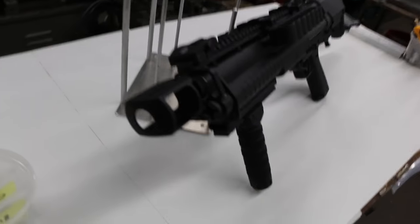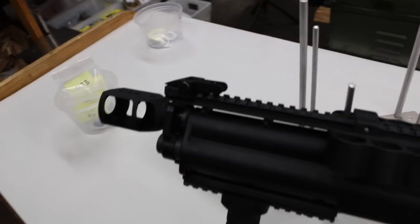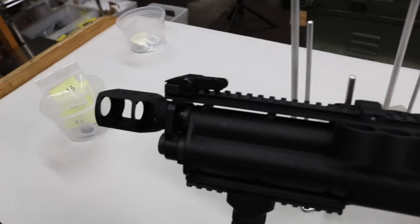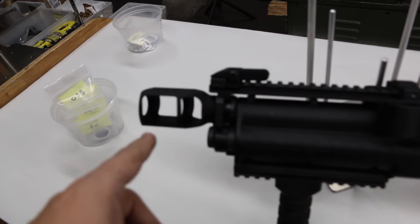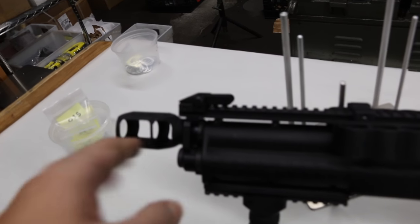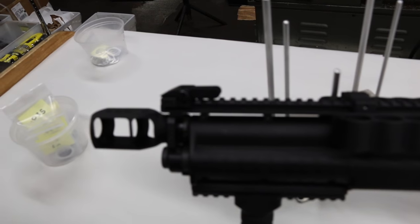We are all about making products that improve the KSG — it's about performance, not flare and extra weight. We try to keep this light at two ounces. We're going to make one in steel for guys who want steel — we're working on it, but it'll double the price because steel requires going a lot slower to machine all this detail: the angles, five-axis machining, coming from different angles, turning it, drilling it — a lot of work.